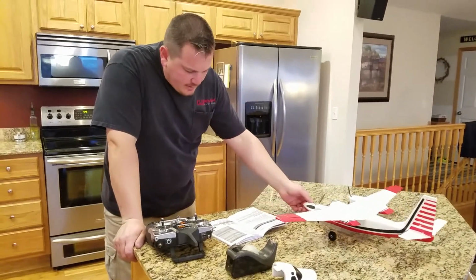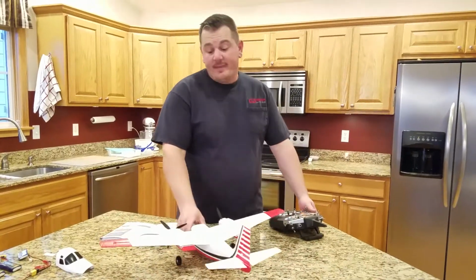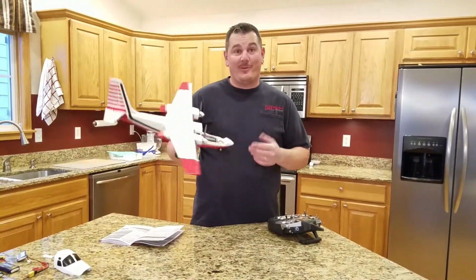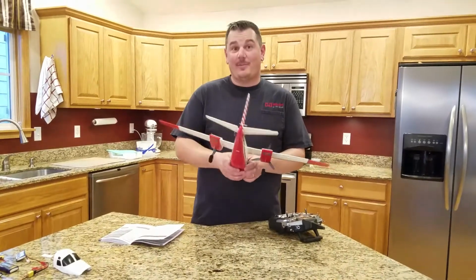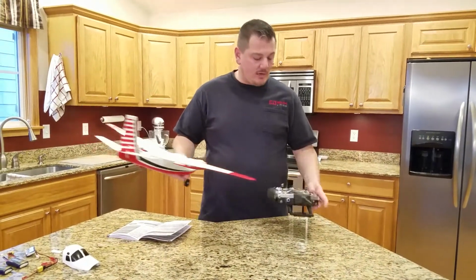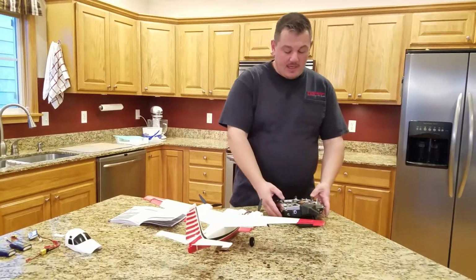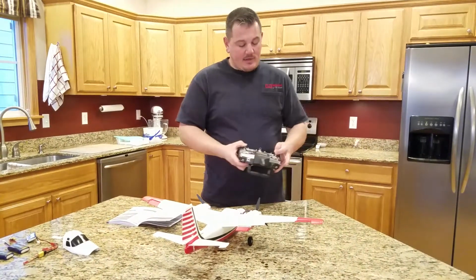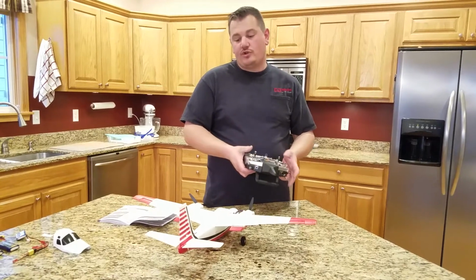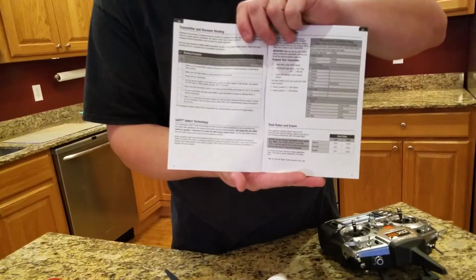Let me take a look at this real quick and we'll come right back to you and explain what we did wrong. Okay, guys, after much frustration, pain and suffering, as is not atypical when working with radio-controlled aircraft, but we were gluttons for punishment, I can't find that Safe Select works. I've tried everything. I've changed the range on my gear channel up and down. I've changed to different channels. I've attempted to cheat and actually hold the sticks out and do assignment controls, which is similar to what you have to do on other transmitter setups. I can't see that Safe Select exists on this model as it sits.